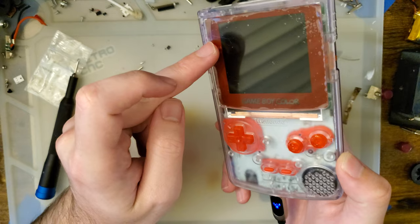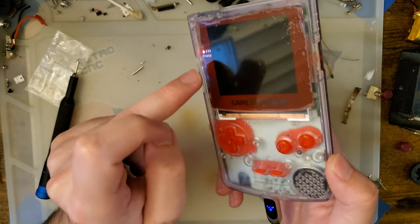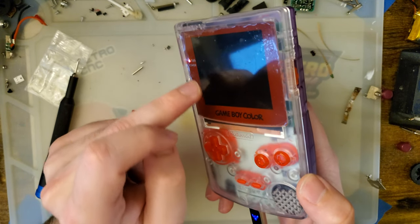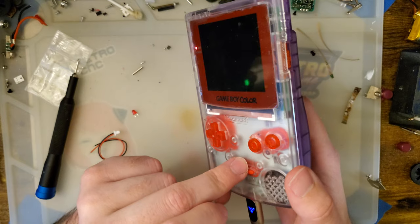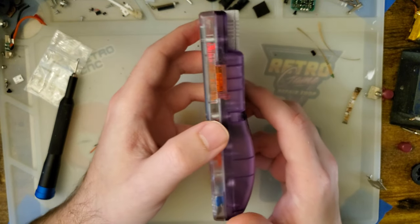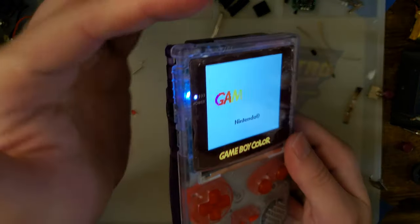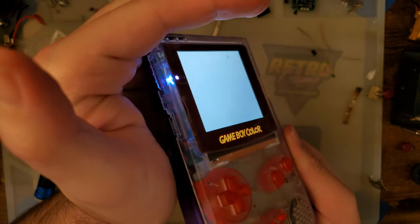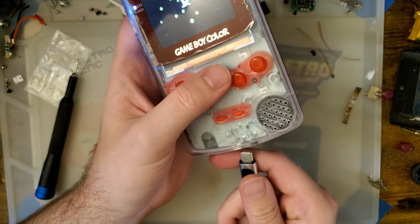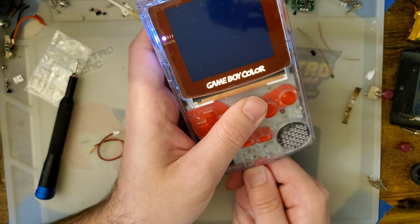The battery light, I believe, should still be hooked up to the battery voltage, which means you should notice it getting dimmer, but a lithium ion battery voltage is still going to be a lot higher than alkaline, so it's not going to be nearly as noticeable as it dims. Get an idea for the brightness at a relatively charged battery and then drain it down and you'll see what I'm talking about. It is there, but it's not great.